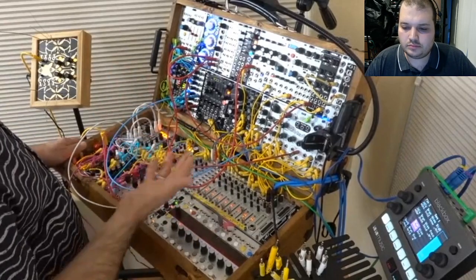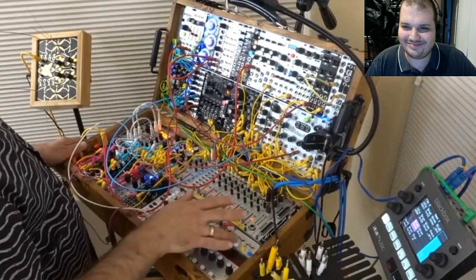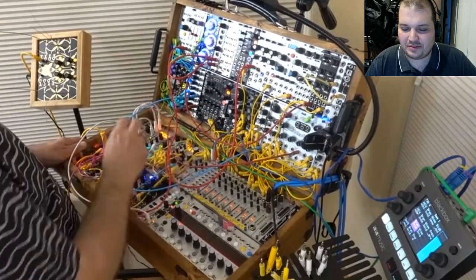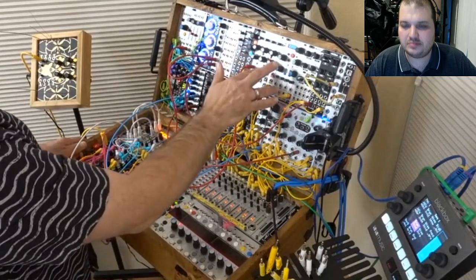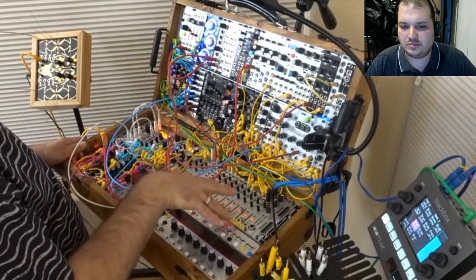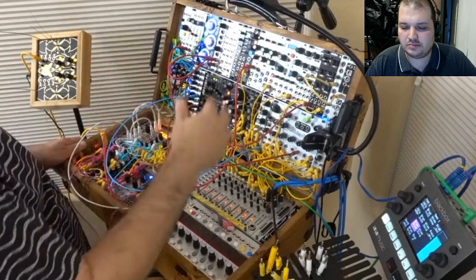And what I actually did in that case is I split the pitch voltage. Yes, I know. I always say don't split the pitch, but I did. I used one of it to transpose the oscillators, but then also copy that off to transpose the kick drum and the plonk. So I could use a buffered mult copy of my transposition voltage to retune the percussion elements while the whole sequence was transposing as well.